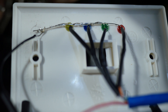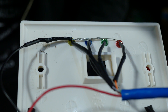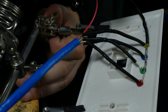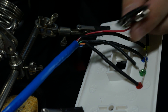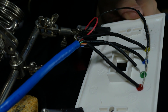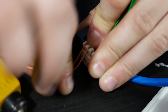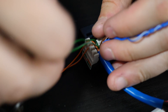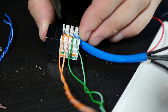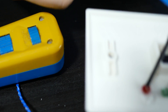Take the negative lead, put some heat shrink tubing on it, twist it into the end of the cathode, solder it in place, and seal it down with the heat shrink tubing. With all the excess wire, pull the remaining conductors down and gently move the sheath as close as possible to our heat shrink tubing — too much pressure can damage the cables. The remaining wires are now exposed; put them into the keystone jack and use the 110 punch tool to punch down all of our conductors.